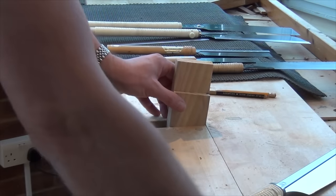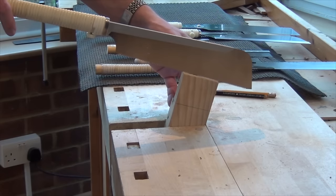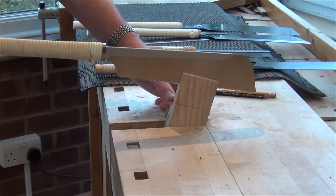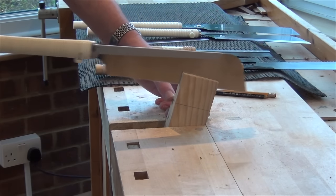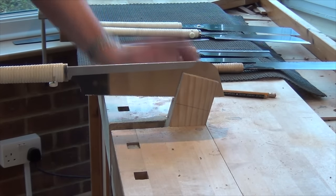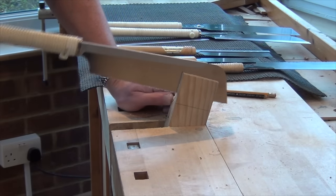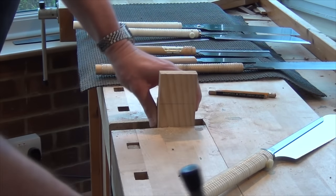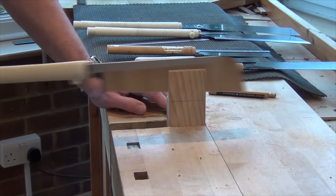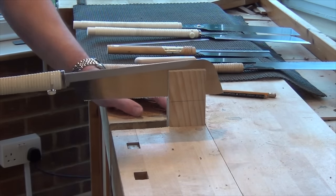Now I can turn this round, track that line, see where I'm sawing, and make sure it goes nice and straight. I've raised my shoulder up here because of the angle of the cut, but I'm still keeping my wrist nice and straight. Because of the back, I need to just use the tip of the saw. Come down to the line — I've got just a little hill in the middle, so I'll square that up in the vise. Then just using the area of the saw plate which is still deep enough, and cut through right down to the shoulder line.